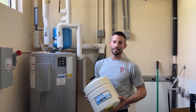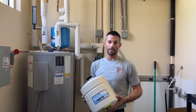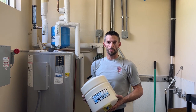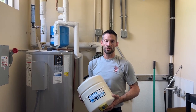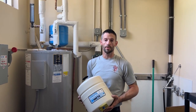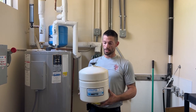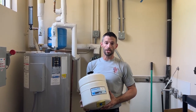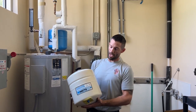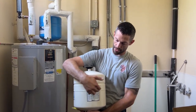The next step is to replace or install a five-gallon expansion tank. The reason why we put this expansion tank in is because it absorbs the expansion and contraction — the thermal expansion of the water when it's heated. A lot of people do not do this; they just install the tank and leave it because they do come pre-charged with air.